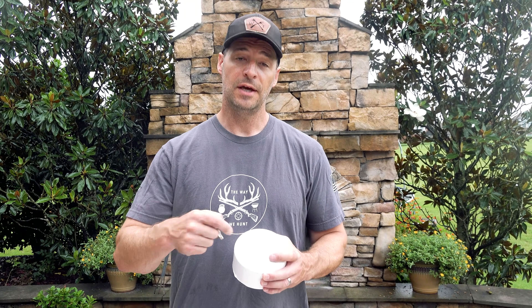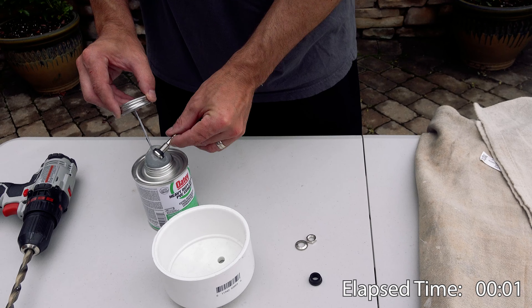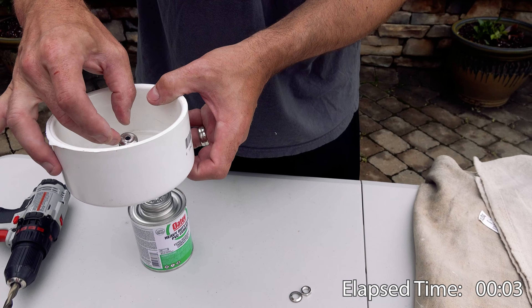About the only other piece of assembly that I need to do is bore a hole into this 4-inch end cap and install our metal air valve. I'm going to use a 13/32-inch drill bit and our PVC cement.